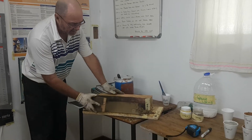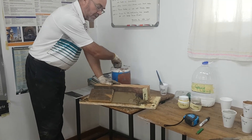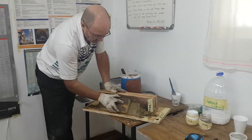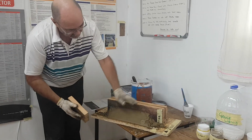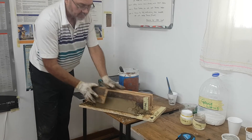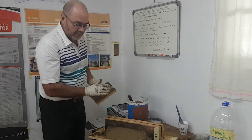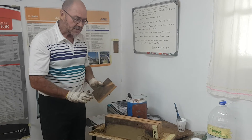Once we've applied enough of the wet mix onto the triangular fillet, we will take the wooden float to get this 45-degree angle. Sometimes it'll be a curved fillet, and the whole reason why we do the fillet is to cater for movement in the 90-degree corners.